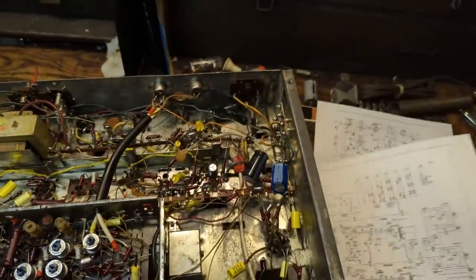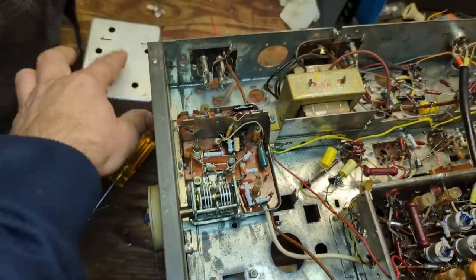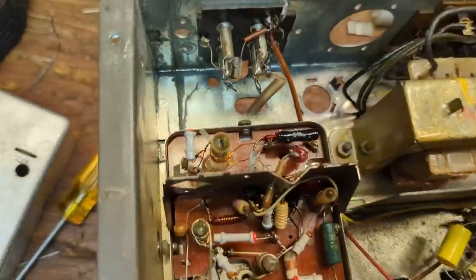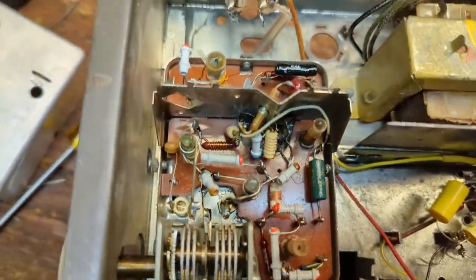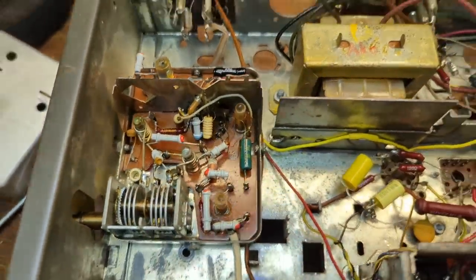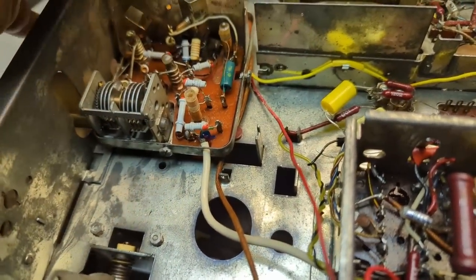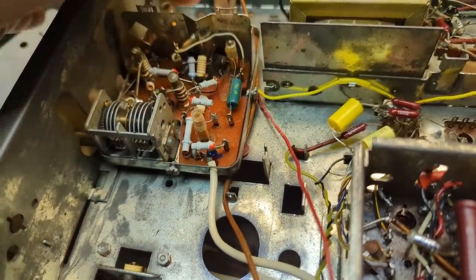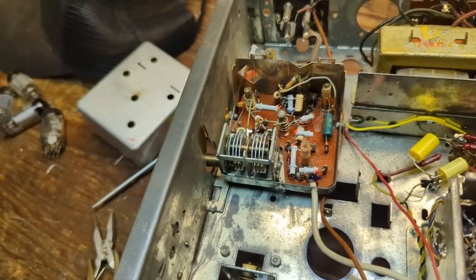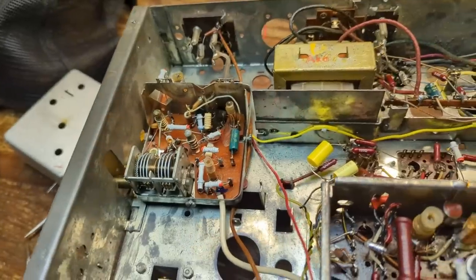Yeah, I did. I need to go inside and print it. But what I did is I removed the cover of the FM tuning condenser so I can expose the pins of the ECC85. Because what I'm going to do here is see if I can troubleshoot why FM, the signal's coming in, but it's not really getting amplified.